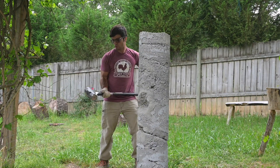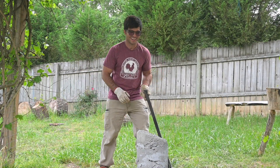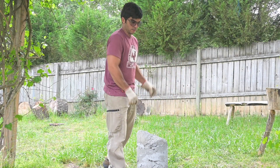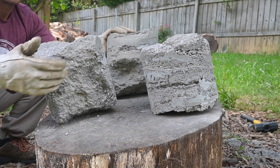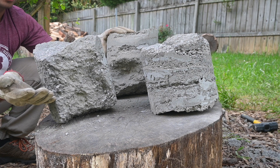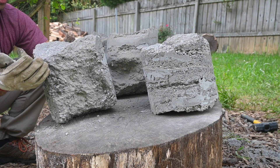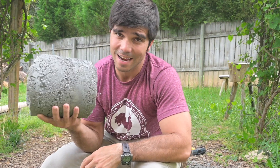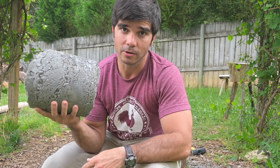Golly, that's a huge hammer — 16 pounds! You can't layer it. If you layer it, you're gonna stratify all these large rocks. The large material is gonna come to the top, just like your Cheerios, and then the smaller material is gonna go to those lower layers. Don't do this. Do not layer it. When I did dry pour this way, I didn't know it was gonna actually turn out so terrible. Honestly, this is not gonna work out. I'm glad we did this — this tells us definitively: do not layer your dry pour.